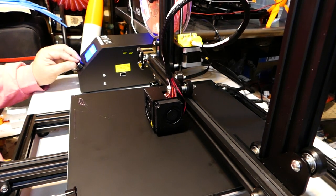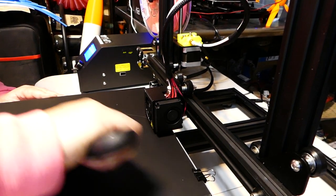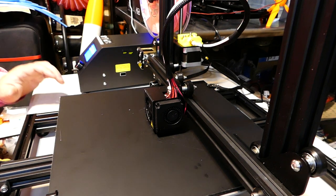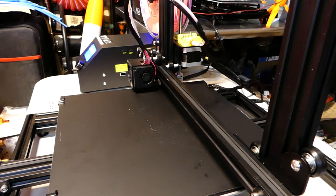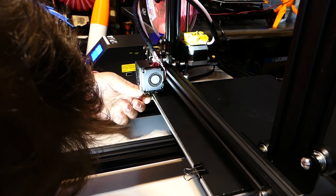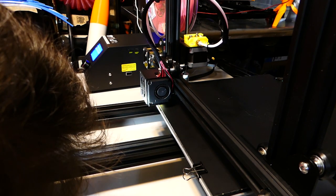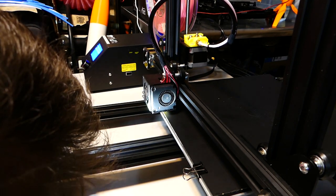All right, now what you do is you stop it, restart it. Stop print. Scrape off your mess. Do it again. Lower the speed this time. Lower down to 25%, 30%. It was a little too low, so it was stuffing the nozzle. Now it's not.